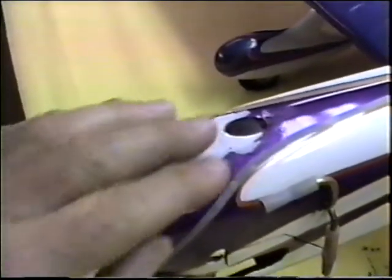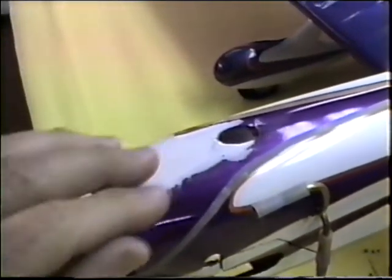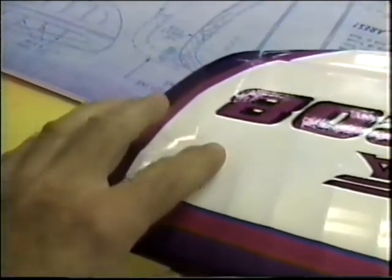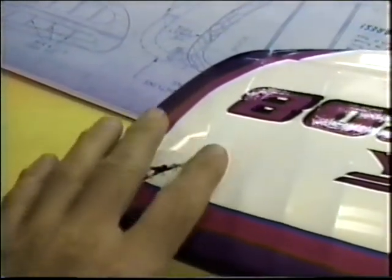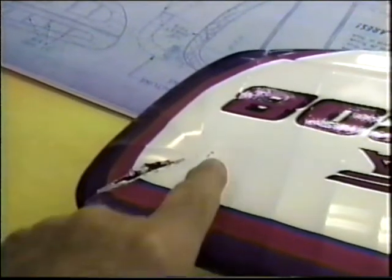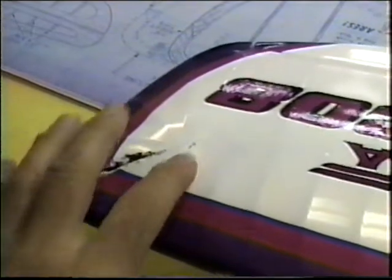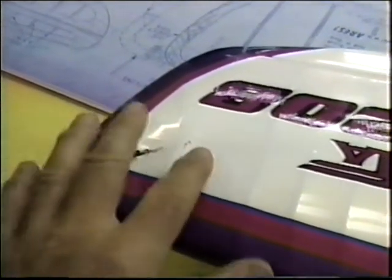Now, this stuff's already dry. This dried well. Let it dry a little more. Let's see, you're going to probably have to add some more. Oh, yeah. Do it in thin layers. There's a flat spot on that. Do it in layers. What I did, I dropped a few drops of thin CA on here, let it kick normally. Just hit it with some sandpaper. I want to see if I can seal that. And then, of course, the trick is can we blend it in and flare it in.